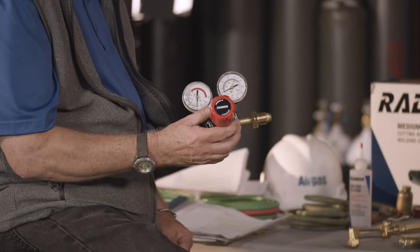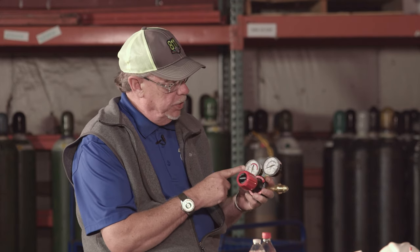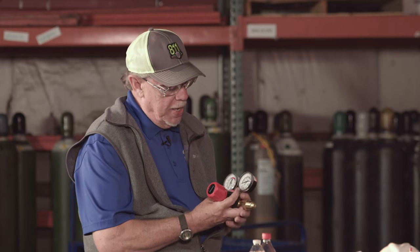The use of the proper leak detection fluid is critical. Ask operators what a drop test is and how they leak check — you'll find many can explain it. Also note that there are plastic lens covers over regulator gauges for a reason. It's not uncommon on an inspection to walk up to a cylinder set up with oxyacetylene on a cart and notice positive pressure on the needle with nobody operating it. That means the operator left the system with pressure on it, which is a hazard. Ask how long it's been that way — if it's been 24 hours, it was left in storage with pressure on the regulator. If the person just stepped away briefly, they're allowed to shut down at the torch handle controls.